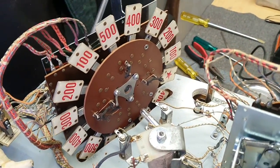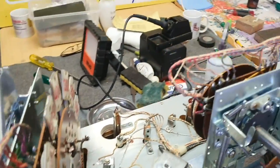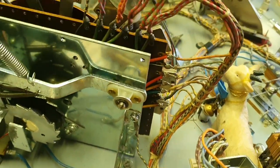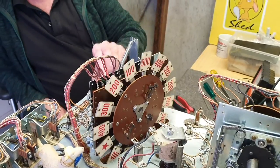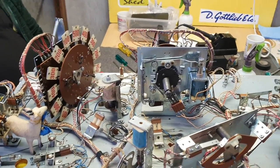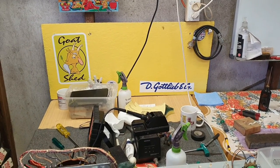The roto target's all back in the machine. We had a few wires that were a bit dodgy, so we've re-soldered those — they were just hanging by a thread, so it's always best to take care of that. We ended up changing that spring out and put a stronger spring on to get the return happening, because that's the important part. Soldered those wires back on and, most importantly, we've put the ground common back on. So, we'll watch it now and watch it spin. There it goes — look at that! What's important is that bit of fallback, and that spring does control that — it falls on the contacts. So, another successful roto target refurbishment. We hope that you can get your roto targets working as well as this one with the help of this video. Don't forget to give us the big thumbs up, like and subscribe to our channel. Thanks for watching. This has been another Goat Shed presentation.